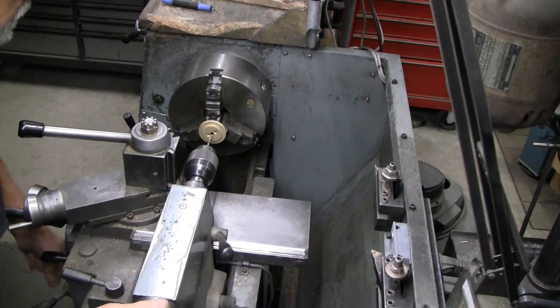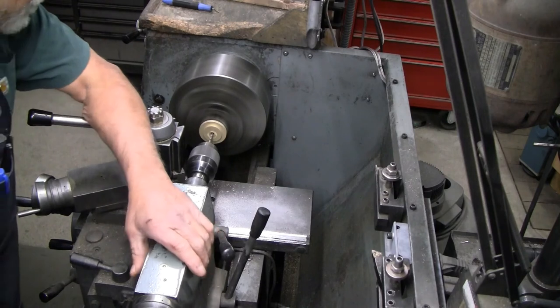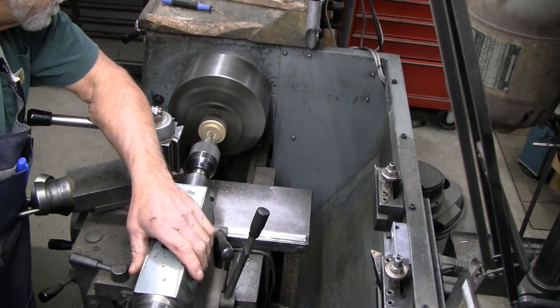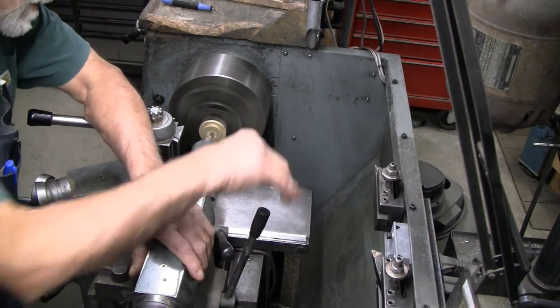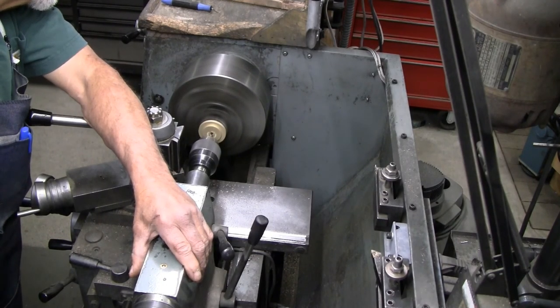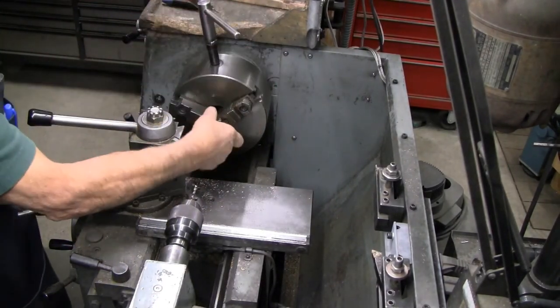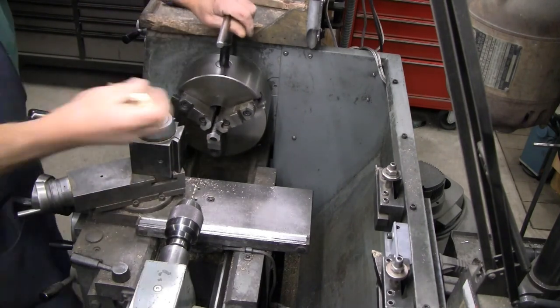Now let's wind it up and clear out. The first half inch or so will be clearing out the adhesive that cured in there overnight, and the next 3/8 of an inch or so will be drilling into the new plug, the new dowel that was installed. That looks good for that one. Times two.